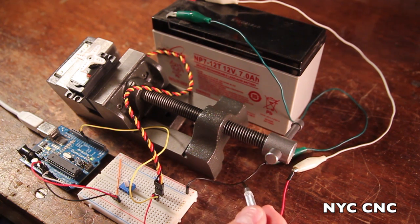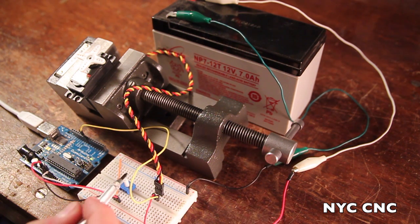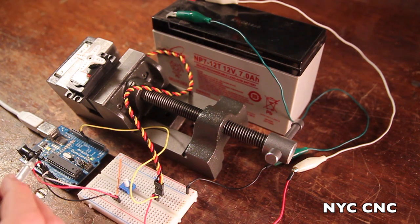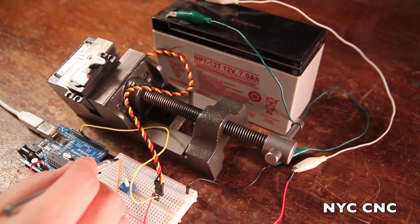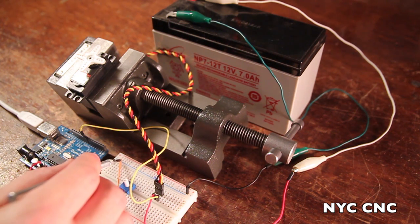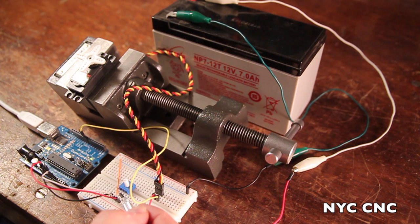The ground rail is then directly connected via this black jumper wire to the battery's negative terminal. By using an external power supply, the Arduino can support higher current, higher power servo motors. It's necessary, however, to establish a common ground by connecting the battery's ground to the Arduino's ground. I'm doing that here via this orange wire that connects the ground connection from the battery to the ground connection I'm already using for the potentiometer.